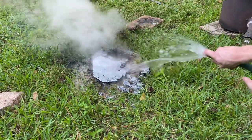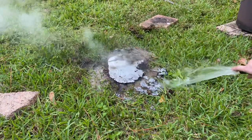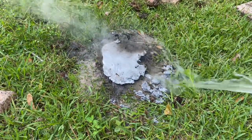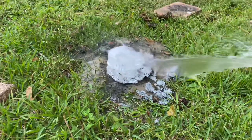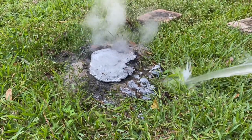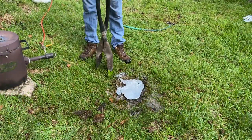Yeah, the metal's so hot in that portion in the back there that it creates an insulating barrier of steam between the water and the metal, so it floats on it like a hockey puck? Yeah, one of those air hockey tables. Yeah, okay. That's the word. But once it's cooled down enough, it's still insanely hot right now, but it's just not hot enough to instantly vaporize that steam. Time to start digging.